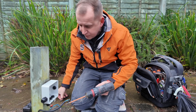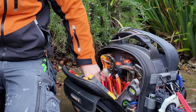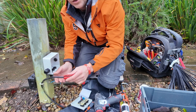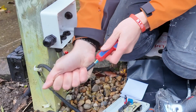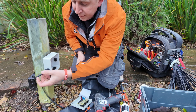Fix it back onto the post and then poke the supply through. I'm going to strip it back first. If you haven't got one of these, get one — they're perfect for stripping flex cable. All you do is put it in there, wrap it round and pull away, because it's got this lovely little blade in there. Way easier than trying to do it with a pair of cutters.